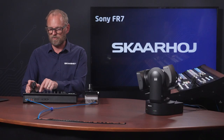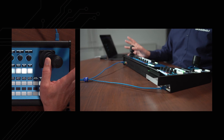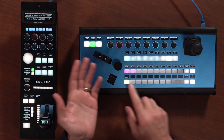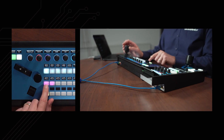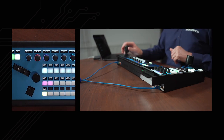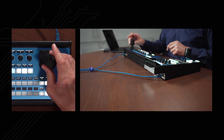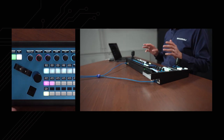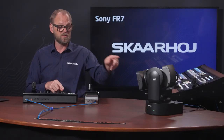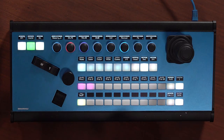The same applies to the joystick — I have a quick pan at full sensitivity, but if I turn it down to about three, a full swing of the joystick gives slow movement. You have all that precision on the PDC Extreme. We also have presets. I'll store a preset by pressing and holding — it turns green and has stored the preset. I move the camera, zoom out, and press and hold to store a second preset. Pressing the first one quickly recalls that position — you see it zooms in and goes to the pan-tilt position. Presets are working.